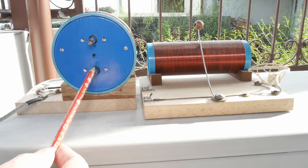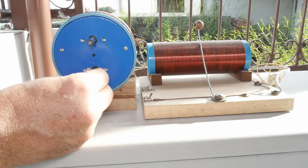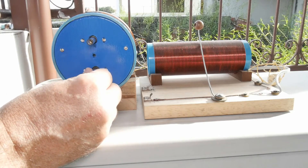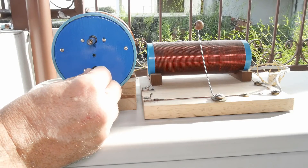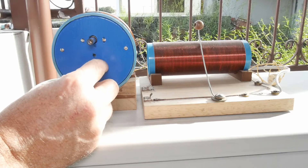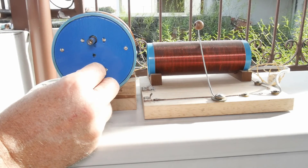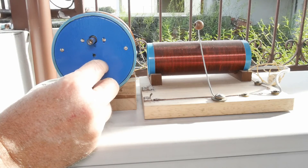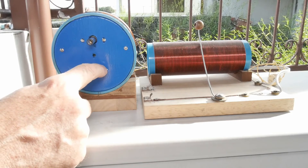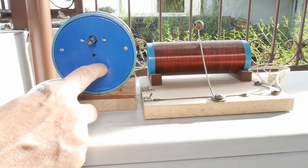For the ARRL version, the tuning is very difficult. You have to typically start with one capacitor, tune it a little bit, go to the other one, tune it a little bit, go back and forth — and it's easy to skip over a station by accident. But as far as clarity goes, you cannot beat this one. You can get a very weak radio station and tune out everything else. So for clarity it's absolutely wonderful, but for tuning it's a lot fussier and less straightforward.